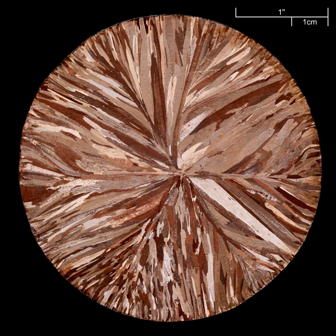Armor etching, using strong mineral acids, was not developed until the 15th century. Etchants mixed from salt, charcoal, and vinegar were applied to plate armor that had been painted with a maskant of linseed oil paint. The etchant would bite into the unprotected areas, causing the painted areas to be raised into relief. Etching in this manner allowed armor to be decorated as if with precise engraving, but without the existence of raised burrs, and it also prevented the necessity of the armor being softer than an engraving tool.